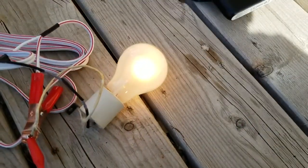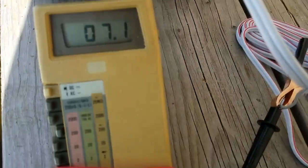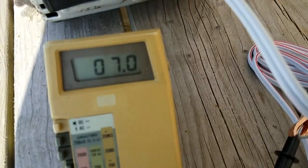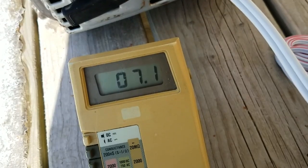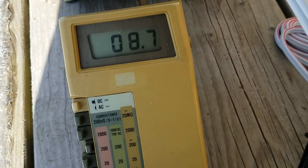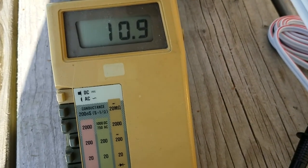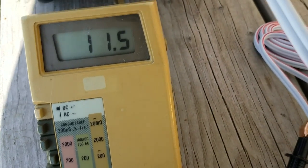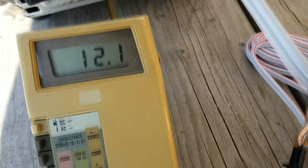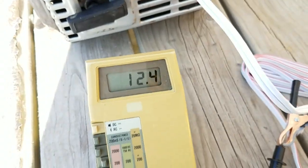You can see here a light bulb I showed a few minutes ago — this is actually a 12-volt light bulb meant for automotive troubleshooting. You can see the generator loads down a bit and the voltage drops a bit when that light bulb is connected. So of course you can use the DC output for more than just charging batteries, but there is a big caution with that.